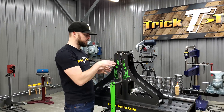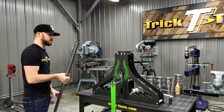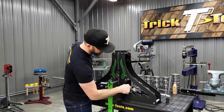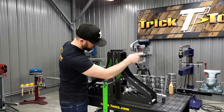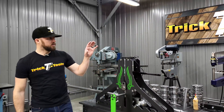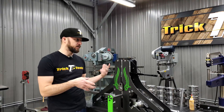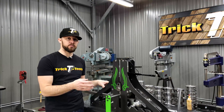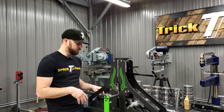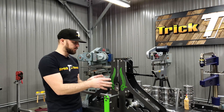Once you get the machine set up, you get your material in here. We have inch and a half round tube dies in here right now. I'm going to stick this piece of inch and a half tube in the machine and line it up right on this roll. We'll put a little bit of down pressure on it to lock it into the machine. The digital readout allows you to do repeat bends — you want to find a zero point where all your dies are touching the material and it's held in there with no wiggle room, a nice firm placement of your tube.